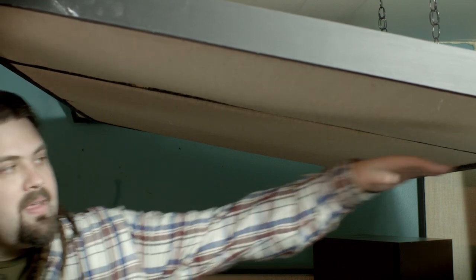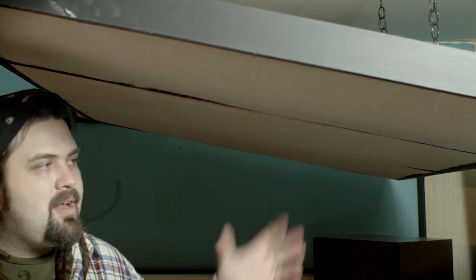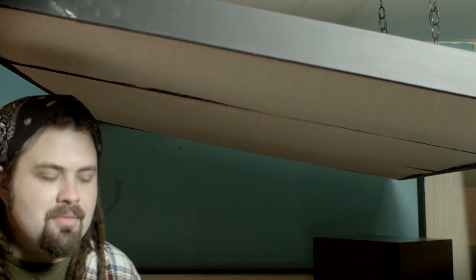Maybe I'm hearing a bunch of peaks, maybe a bass guitar note of G is giving me problems. Maybe a high tom, maybe a 12 inch tom, is really screaming loud. So what I'm doing is getting a few different frequencies by tilting the panel. I'm blocking frequencies that at their highest point would be at this distance, and others at their highest point being more like this distance, okay? So I'm getting a range of frequencies, building in some forgiveness as far as the accuracy of the measurements and all the different things in the room.